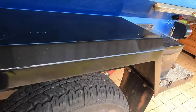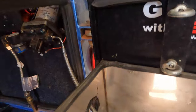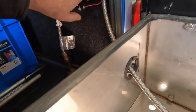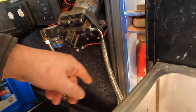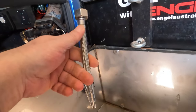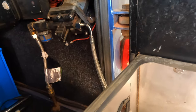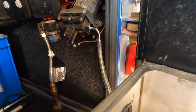All right, now for the back, I had another one of these cables, but I didn't know you could get these with the right angle bend. I was looking at a marine catalogue and I seen them. You can get them from Bunnings as well. Okay. Before I just had an end like this, and by the time I bent it, it was very badly kinked. Now the problem I had was you can only get these in 300, 450, and 600 millimeters. That's a 600 millimeter one there,